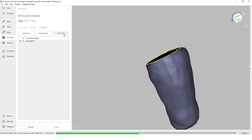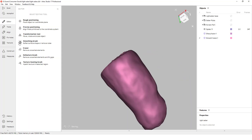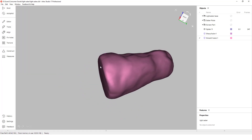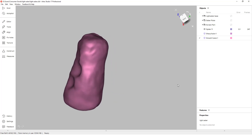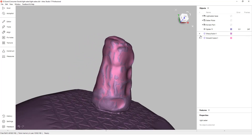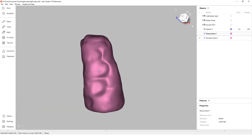It's also good to check the internal space of the mesh with tools like x-ray to ensure no parts of the mesh are inside of itself, making it non-manifold, which would be difficult to print. We can see the difference between our sharp fusion and our newly smooth mesh when they are overlaid. Overall the mold kept its shape but we have removed all enfolded and sharp edges from the mold that would affect the surface quality and the ability to print.